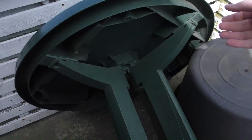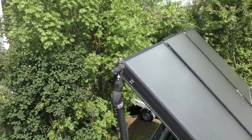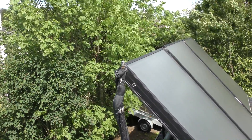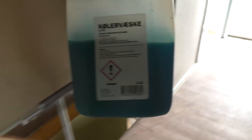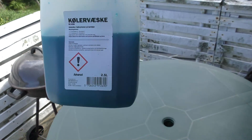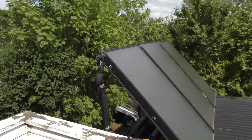Here we are on the second floor on the balcony. Over here are the solar collectors. I'm going to be taking off this automatic air vent — if there's air in the system, the air can seep out through that. I'm going to go find the fluid to put in there. This is what I'm putting in — it's actually for a car engine not to freeze up over winter, good down to minus 36 degrees Celsius. If you mix it with an equal amount of water it's good to minus 20 degrees.